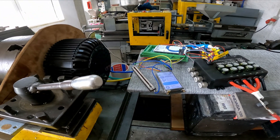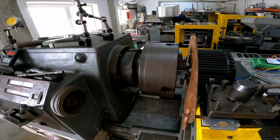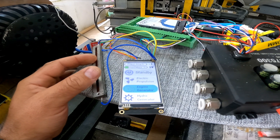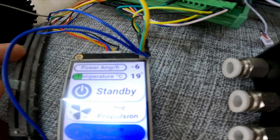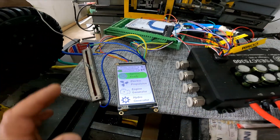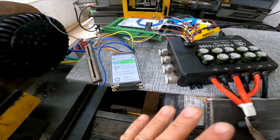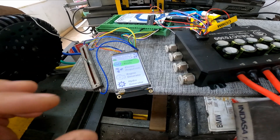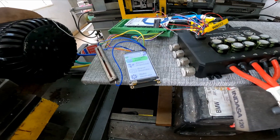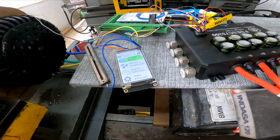I'm going to turn the lathe — it'll be a little noisy. Now I'm using the lathe to turn the motor and because the slider is at zero I'm producing nothing. But if I go up, you can see it's minus 6, and a little bit higher minus 10. It went into system standby on its own because the batteries are full. The algorithm senses when batteries reach 27.5 volts and automatically goes into system standby so it doesn't overcharge the batteries — that's an important feature.